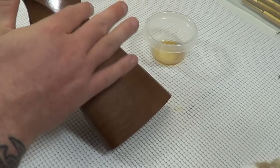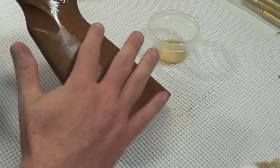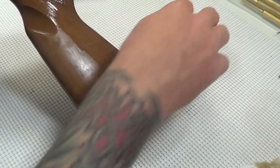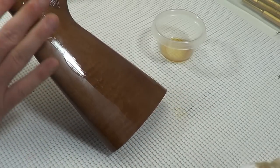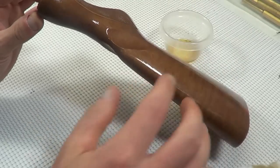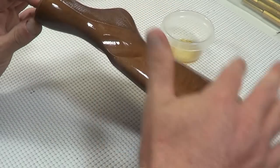She'll start coming together real quickly from here. At this point we just want to build up the coat, build up the finish so it's durable and will protect your wood. Probably what I'll do is take a quick video of each coat I put on until I decide to stop — probably 10 coats is what I usually do. Some guys do 20, 50, whatever, but 10 coats seems to be the right amount for me to have a somewhat normal looking stock. We'll let this tack up like we did last time and I'll give you guys a quick peek at it.